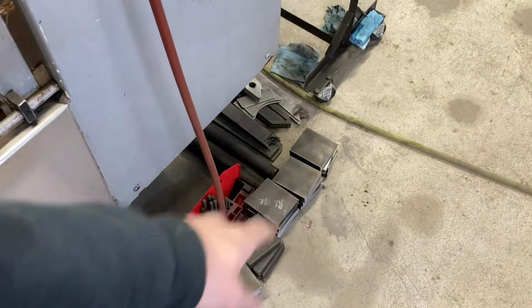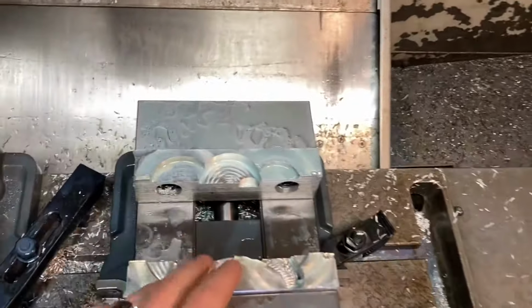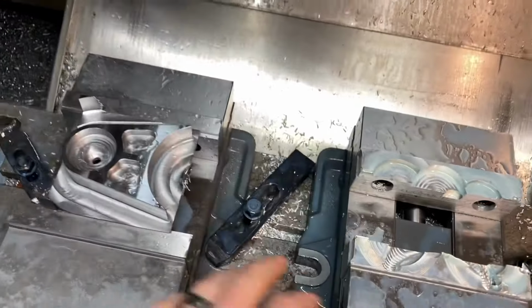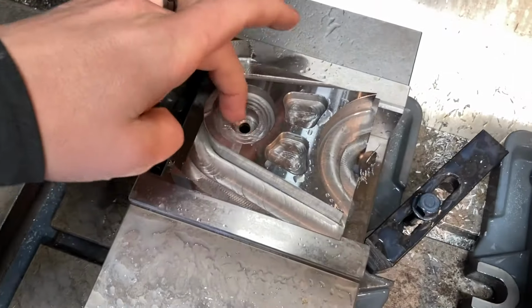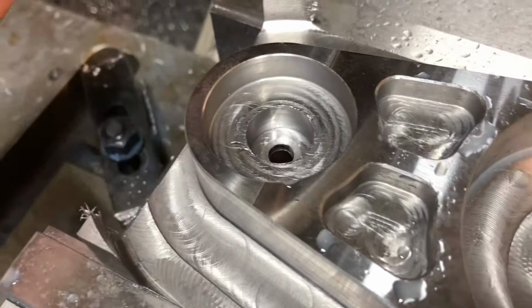I'm doing some welding on a truck and putting some parts on, so I'm gonna try to get this thing running in the background. I've got all of these sets cut and ready to just load in here. I just gotta get this side all proved out. So I just got that all made, and I even had to come in here and add a little bore program to make sure my hole is nice and straight after drilling it. I figure if it's in the mill, might as well make it a nice hole.